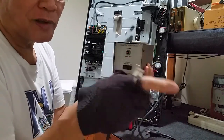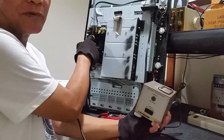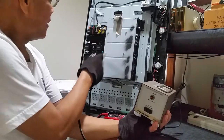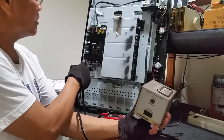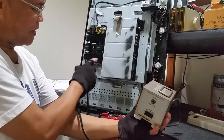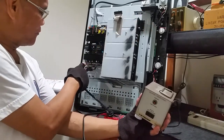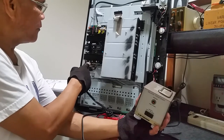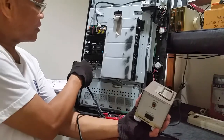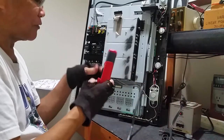Much more if the voltage is high — like this one, the primary side is 450 volts. On the secondary side, these are small voltages needed by every module inside the television: it could be 24 volts, 12 volts, 9 volts, 5 volts, etc. These are safe voltages and the ground connection is safe to touch.